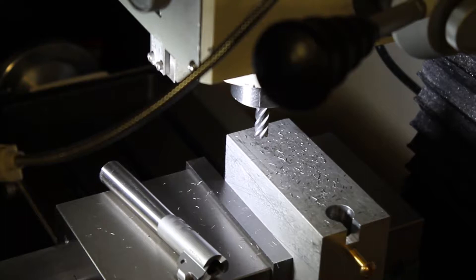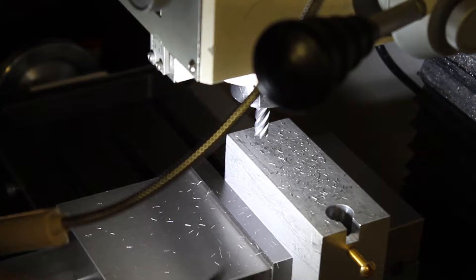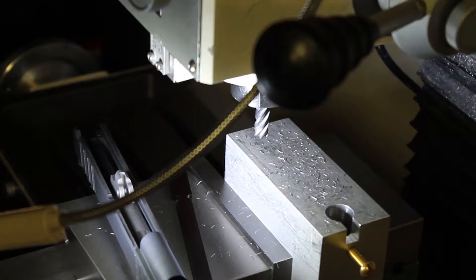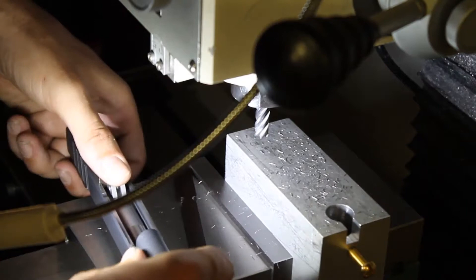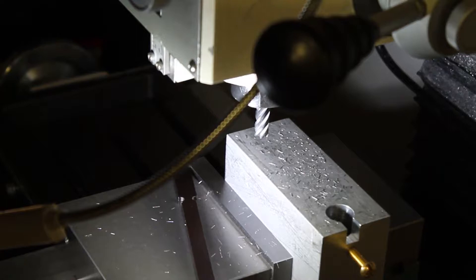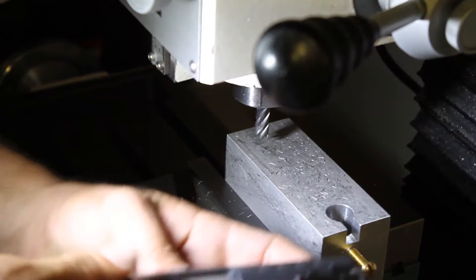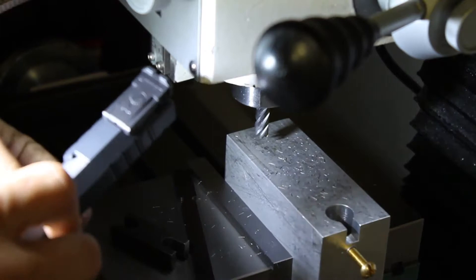We still need to take the hood length — the back edge — but for the width let's test fit. I should note: make sure you have your barrel alignment block when doing this, because if you removed more off one side and the barrel is rotated, the measurement won't be accurate. With the alignment block in place, the barrel is sliding in perfectly with no wiggle. We're good on width.